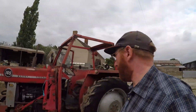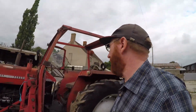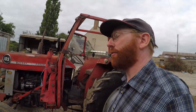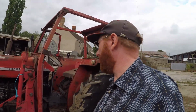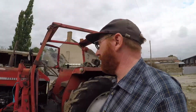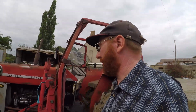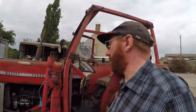Okay, so our biting point is still just as high as it was, although now we're set correctly, I have got a second stage of the clutch for the PTO, so a bit of an improvement there, but I think it's going to be split. That biting point shouldn't be as high as that, I don't reckon. So that's something else to add on to the list of little jobs that need doing.